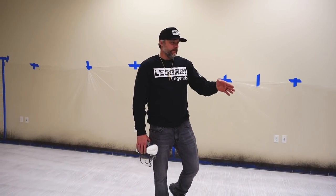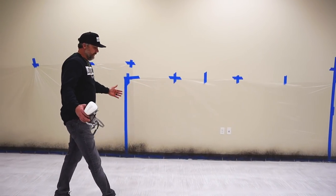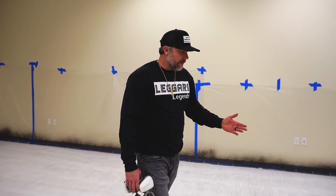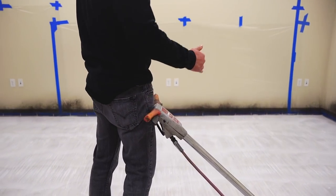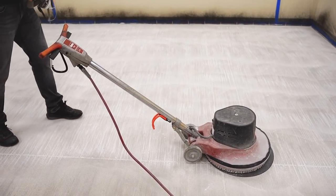So what I like to do, floor sander, 80 grit sanding screens, and then I'll do a section, and then I'll flip the cord around behind me and I'll just push the machine forward. That way I'm not moving the cord all the time. When I'm running this thing, you'll see I'll have it on my hip, and I'm just moving along back and forth. And this is what it looks like. So let's plug the cord in over here now.